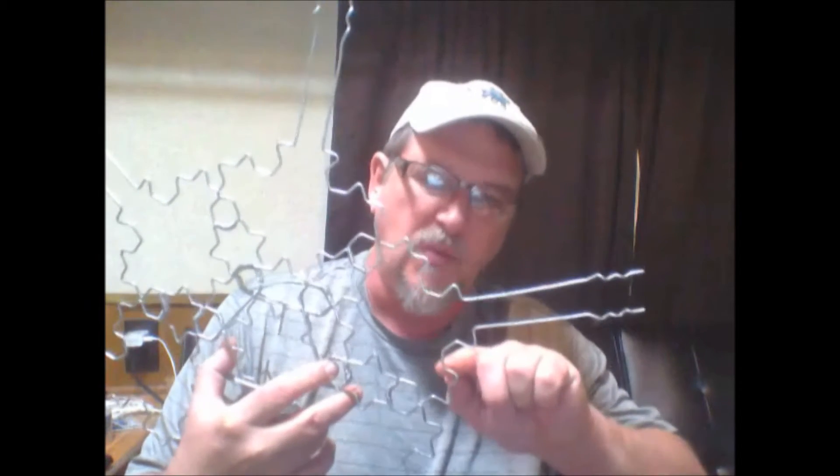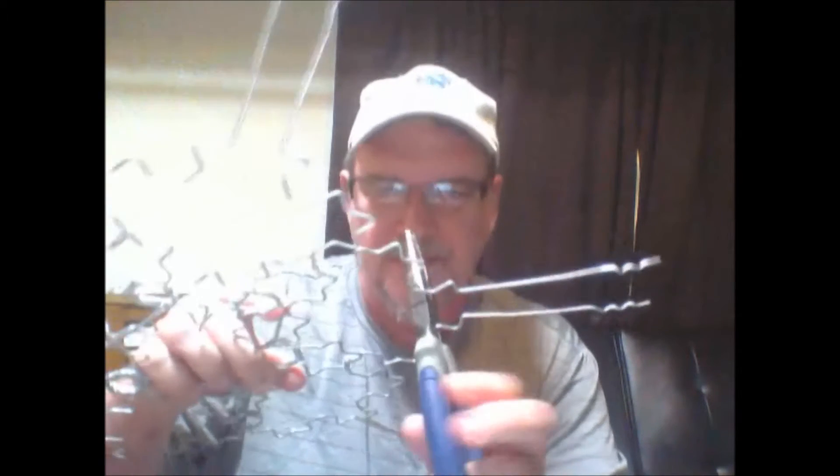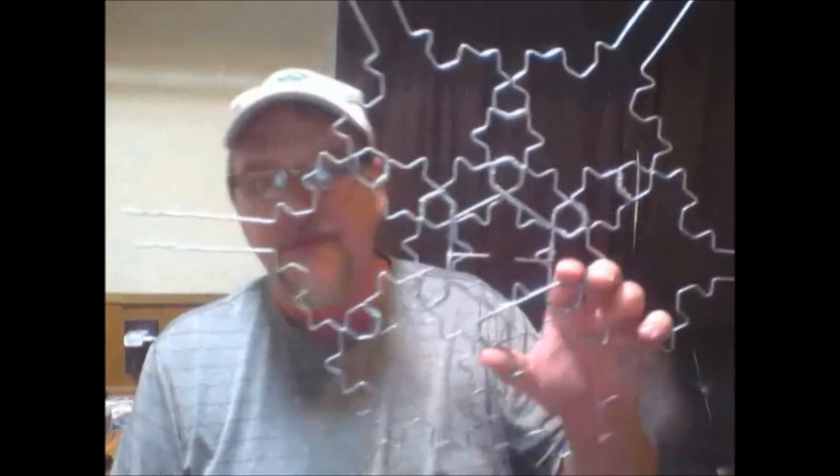One big difference I did on this, which was a lot easier: on my first video I actually measured and made all the lines one inch so they were truly symmetrical, but it was kind of big and bulky. These are smaller antennae, and I decided to just use my needle nose pliers as my measurement guide. For all my obtuse bends, I'd use the inside part of my needle nose as my measurement tool. For an acute angle, I'd go about three quarters up and use that to bend my next bend all the way around on every bend. Then I'd use parallel lines to judge the actual fractal shape — and I think it turned out pretty good, pretty symmetrical.